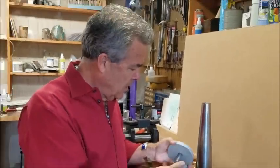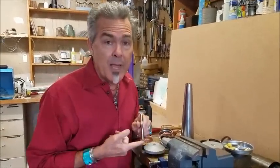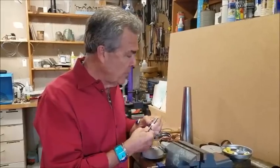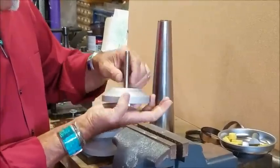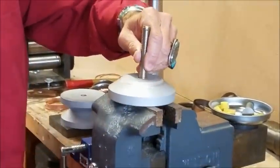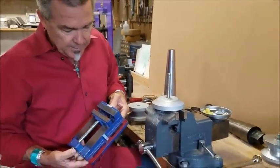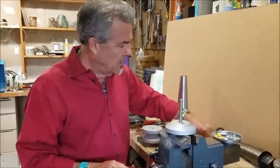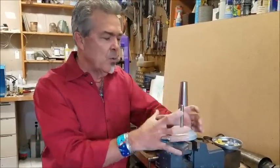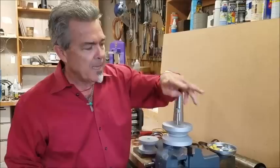We can use this either manually in a vice or with a hydraulic press. I'm going to show you first with the vice. So I'm going to take this other set that I've already used. Put the bolt in — we can put this bolt in either a bench vice, or if you don't have a bench vice, this is a little drill press vice that you can get. They're inexpensive and they work great. We'll bolt it in here, place our bangle in there, put this on, take the nut and tighten it up, and that's how we form it.